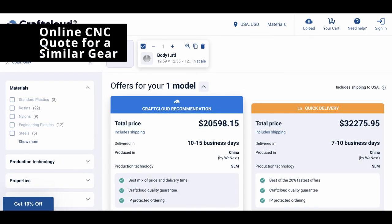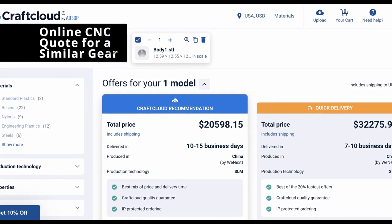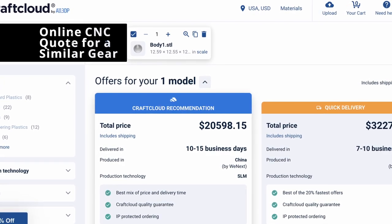Over time that will cause failure. With it being such a weird part and such a weird design, you're not going to be able to just go to any machine shop and get this made, or easily find vendors to buy it from. So if you were to actually use it in a design, you'd need some way to replace this particular component and account for that when designing.